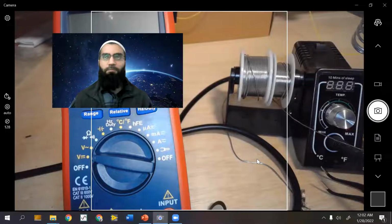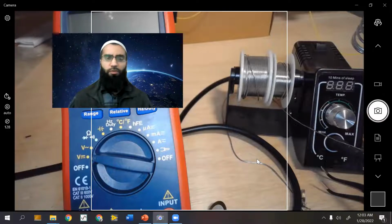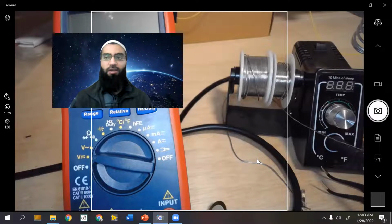The other thing I want to mention here is that depending on how you're doing this, if you're doing it with an oscilloscope, here I showed using a multimeter, a really simple approach, the charge is continuously bleeding off through your measurement instrument, so that's going to cause an interesting imbalance. So after you remove the heat, you can expect the sign of the voltage to change. But I would advise that you use the sign of the voltage during the heating process, not when you remove the heat. So keep that heat steady.